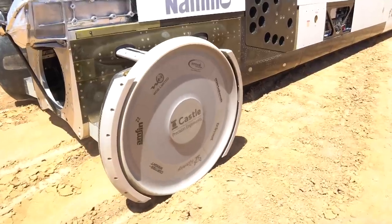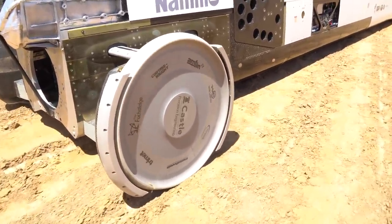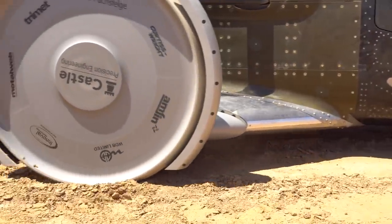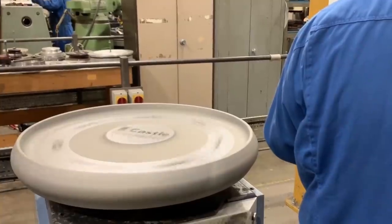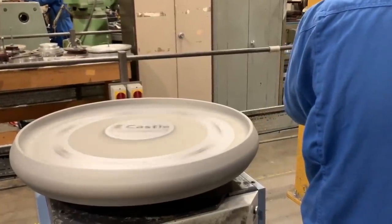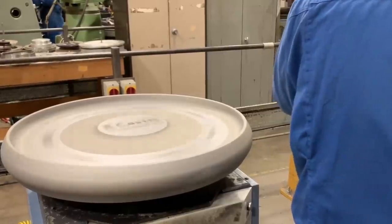There are all these unknowns that keep cropping up, but we were amazed that not only did the wheel stretch completely in line with prediction, but we didn't think we'd get that hot. Now imagine a wheel that is, say, 95 kilos rotating at the speeds we're going at. Balance and wobble matter. On your car, they put weights on it to balance it where your valve is. We don't have that, it's just a wheel. But the level of balance this has to be done to is phenomenal.